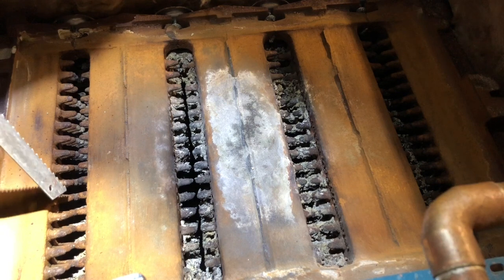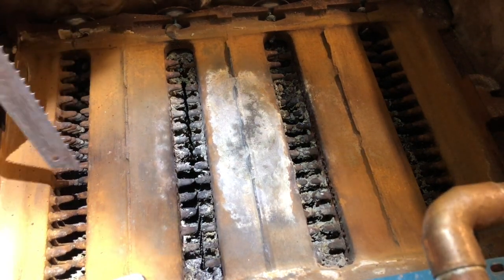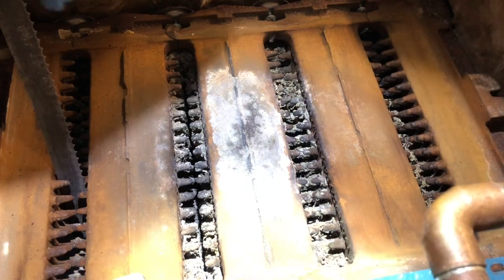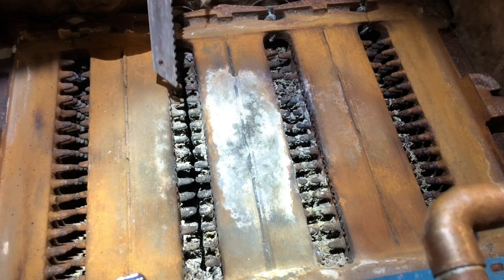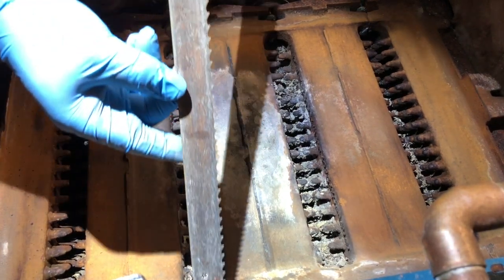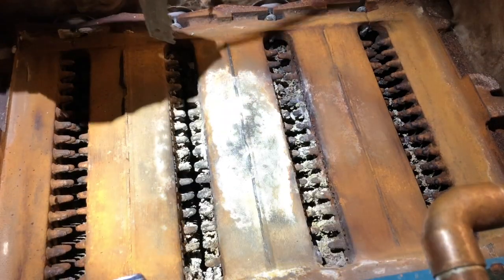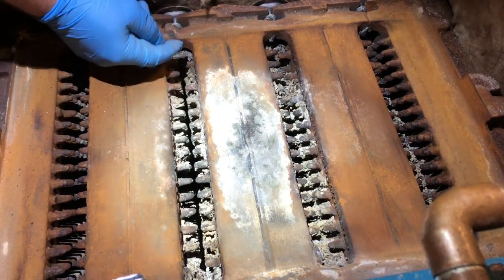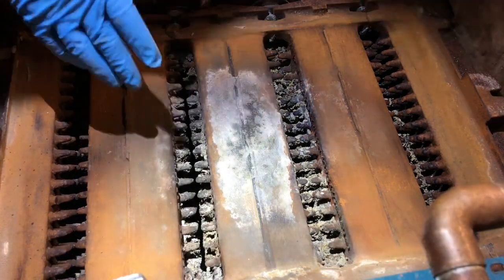The very back of this boiler has a target wall down inside. When you insert the saw, you don't want to go too far and damage it — it's made out of a fiber material. As you're cleaning the boiler, you want to make sure you're going through the heat exchanger at a 45-degree angle all the way across, then go back the other direction at 45 degrees. On the sides there are some covers we can pull off and run a brush horizontally through the heat exchanger — we'll do that in just a minute.